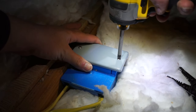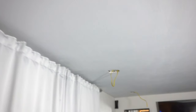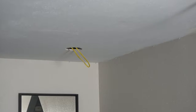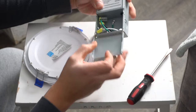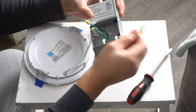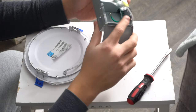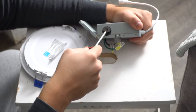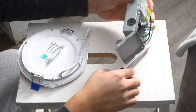I left about one foot of wire at each hole — that should be enough to work with. Your pot light comes with its own J-box, which already has the white neutral, hot black, and green ground wire. Take your flathead screwdriver and pop one of the side tabs out — whichever side is convenient for you.